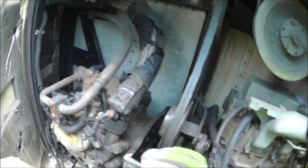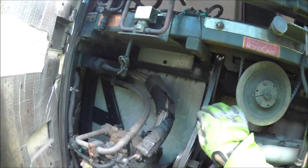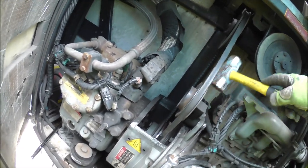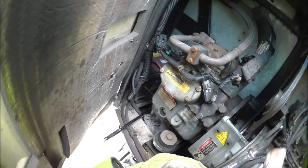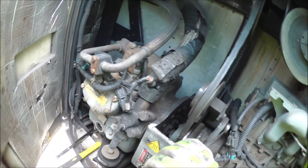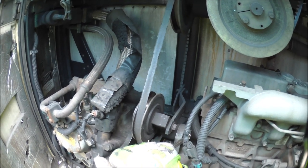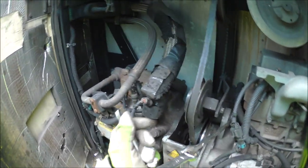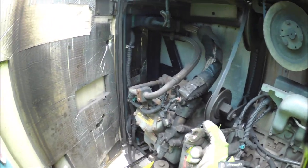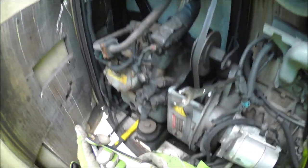This thing is loosening all the way here. I look at the tension, I just give it a tap. I'm going to try to overdo it. It's a little bit looser, but sometimes it'll come back. This is how you can not lose your back by doubling up wrenches like this — it's really simple. Instead of wrenching this way, you put this one on. Makes it longer, but watch out — you'll be breaking bolts if you get into it.